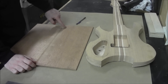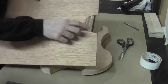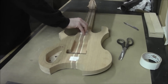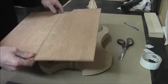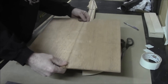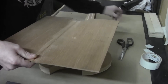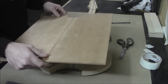I'm going to take this to the bandsaw and cut this little area out so we have something to work with. We've got that area cut out — that's just to get access so we can see what we're lining this side of the bookmatch up to. I've put a piece of double-stick tape here, just two points on the front and back of the body. Peeling those off now. We want to make sure the horn is covered and the back area is covered, but the main thing is lining up the seam with the center point marked on the neck.